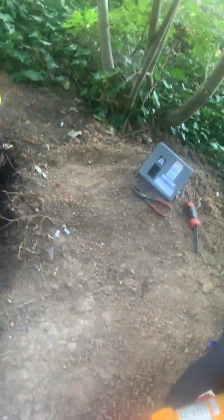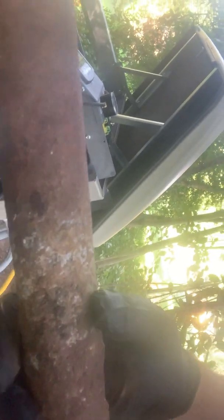For the trenches, per the NEC — my copy is 2014 but I don't think it's changed — it's 18 inches deep. I dug a trench 18 inches deep to get the power down. The gas line was done by the plumber. One nice thing about getting that done was replacing the old gas pipe riser where it comes out of the ground, where corrosion is always most severe. Getting that replaced with new riser pipe was a bonus.